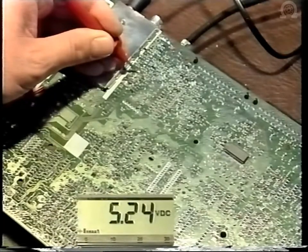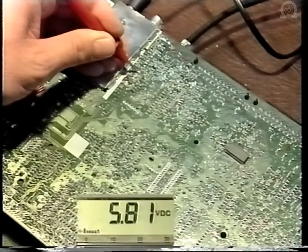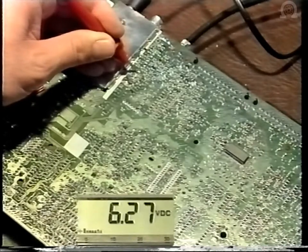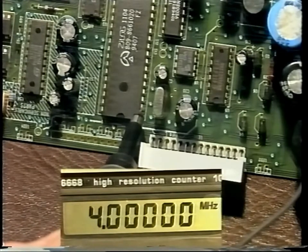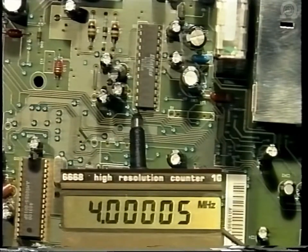As I explained earlier, the frequency synthesis is performed by U9, which receives divider ratio data from the required program from U2. The synthesizer generates a reference frequency from the 4 MHz clock input on pin 12 of U9. And again, you can check this with your frequency counter or oscilloscope. First check on pin 2 of the main microprocessor, U2, and then on U9.